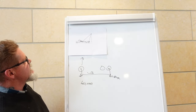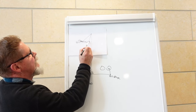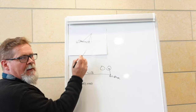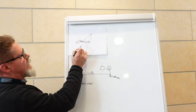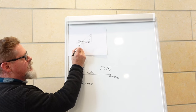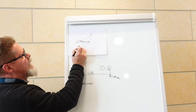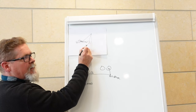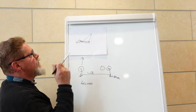Now, the main winch that you use to pick up big things comes through a block right there, goes up through here and drops back down. And there's a big hook on the end of this. There's another winch line that comes from here, sitting usually below the main winch, and this is all in the headache rack. And it drops down and comes through a rolling tailboard, and then it also goes up through that pulley. This is a double pulley, or two pulleys.